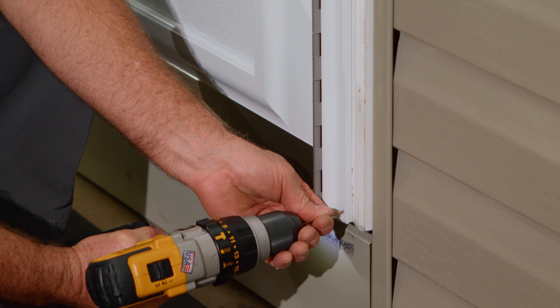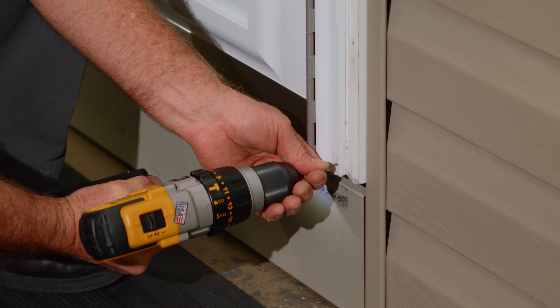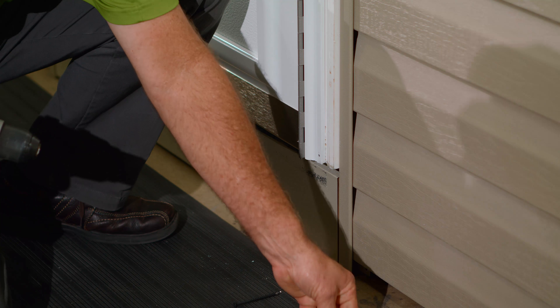It might help you as you understand taking this out. The first thing you're going to want to do is drill about an eighth-inch hole into the face of your screw cover.